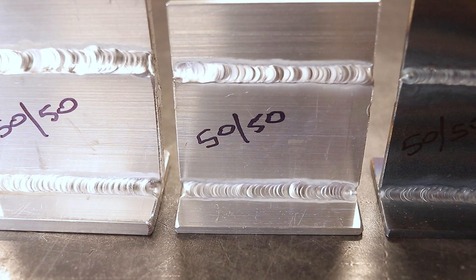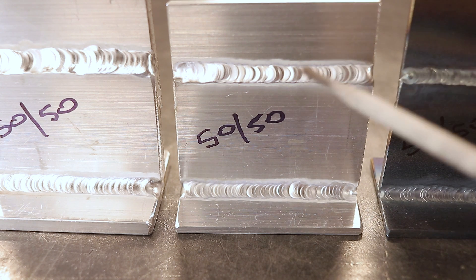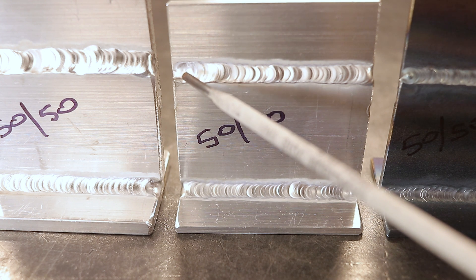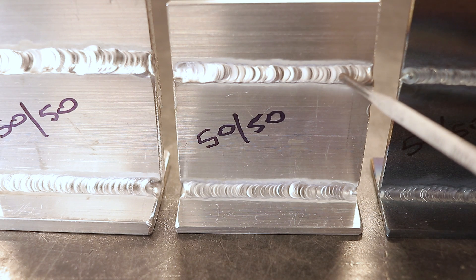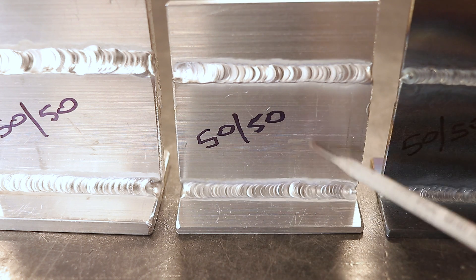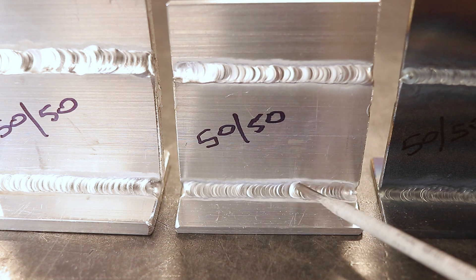On the 1/8-inch aluminum with helium, we're really starting to get clean. I struck the arc and the puddle was forming immediately — I just had to get up and get moving really quick because it was just going. Had to back off the amps a little bit, and then once the metal was preheated the T-joint just flowed in really nice. That was really smooth.